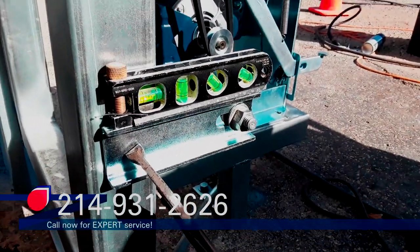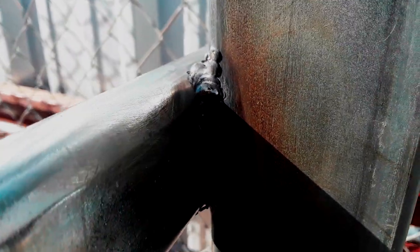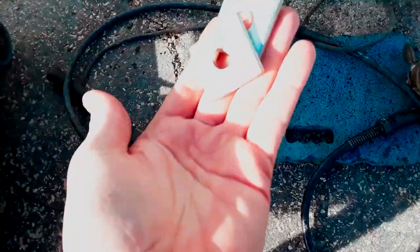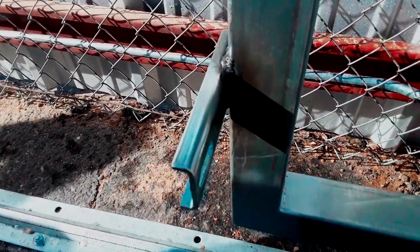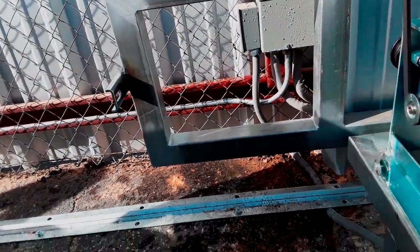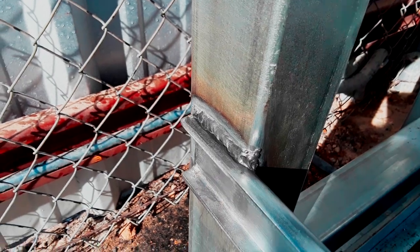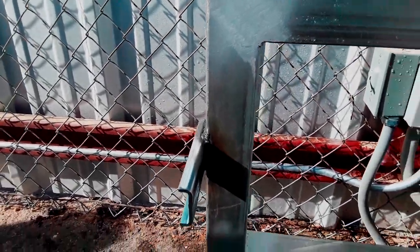The front chain bracket is welded, so now the back one is mocked up and I'll tack weld it on there. The back bracket is welded and ready to go. I'm going to weld a gusset on there for a little more support - take one of these quarter-inch square tabs, galvanized, and weld that right there. I wanted to clean this up first so I could paint behind it, but I'll add a little gusset to help distribute the weight better between that corner.